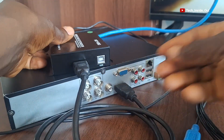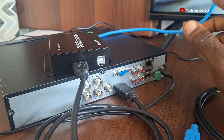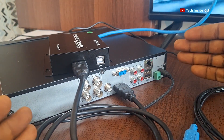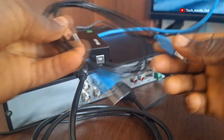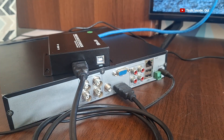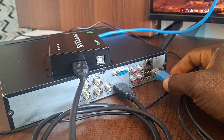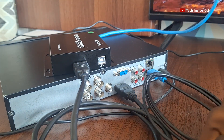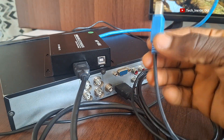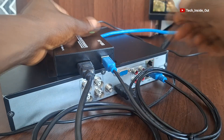And also because we want to be able to operate the mouse from the TV screen at that 120-meter distance where the TV will be, we will utilize this cable which will connect to the position where the mouse that should have been connected to the DVR will be connected. So we'll plug this cable at the mouse port of the DVR, and this end goes into the transmitter of the KVM extender.